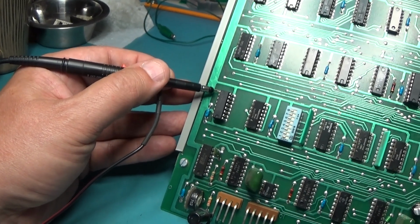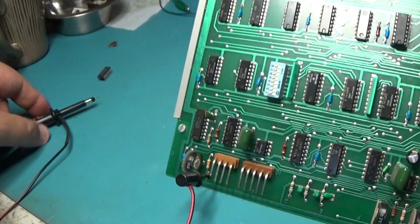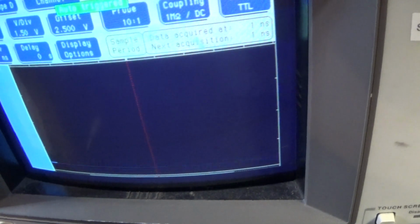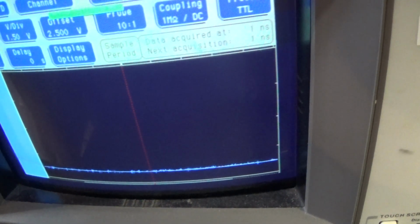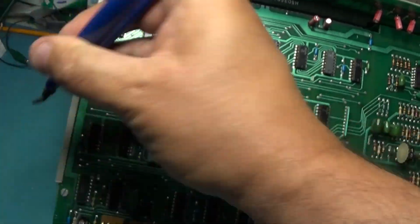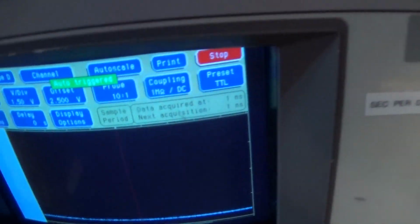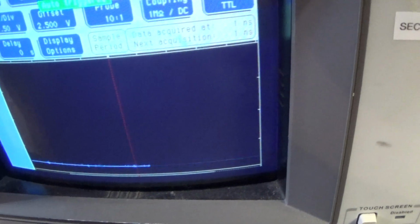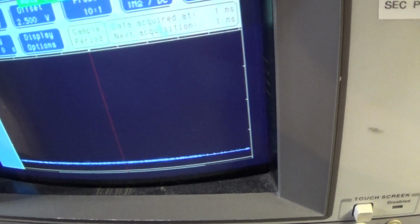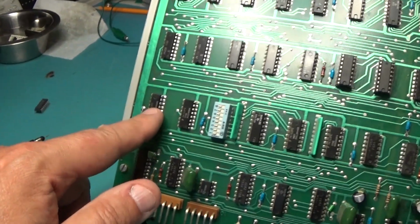Third pin, that's pin 8, 9, 10, pin 11. It's kind of garbagey looking. What if I pull this chip off? Pin 9, 10, 11. See, now it's just pegged way low, which tells me that it may be wanting to go high. See how it's goofy like that? So I think what I want to do is just clip that right out of there. Now let's see what that pin 11 is doing. Well, it's low. Yeah, I don't know. Alright, anyway, this guy right here is no good. So we'll replace this 153.